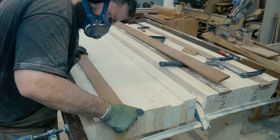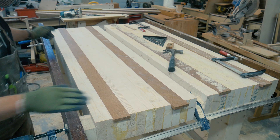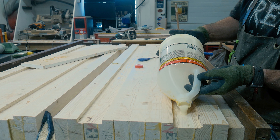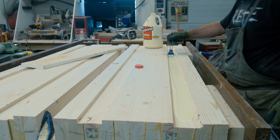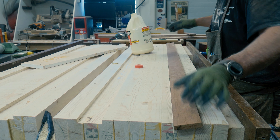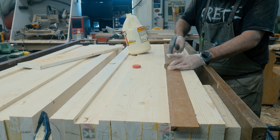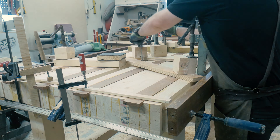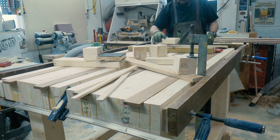This process had to be repeated on all 4 slots, and after making sure they all would fit, I removed the insert, wiped away all the dust particles, and prepped for glue-up. I added a lot of glue and used my trusted old silicone brush to apply the glue everywhere in the slot before placing the insert and gently but firmly telling it where to sit. I did this on all 4 inserts and made a little clamp glue-up art piece that I left for 24 hours before removing the clamps.